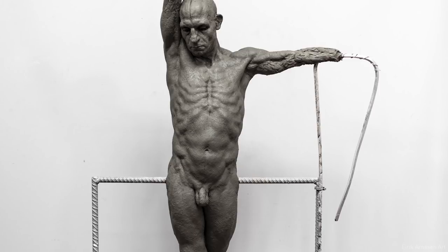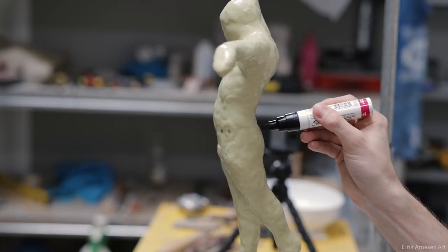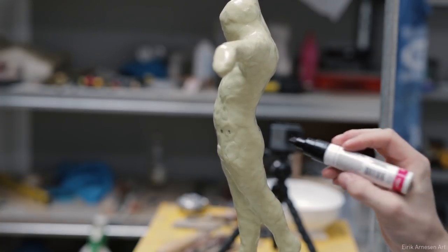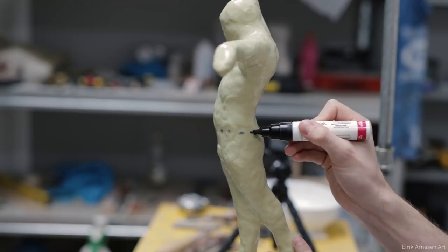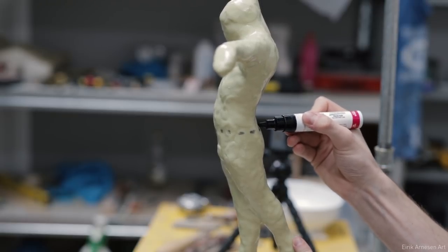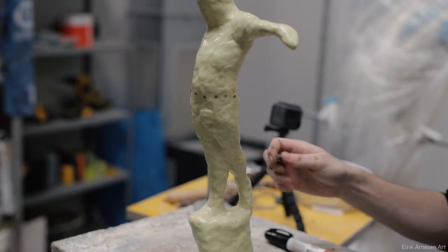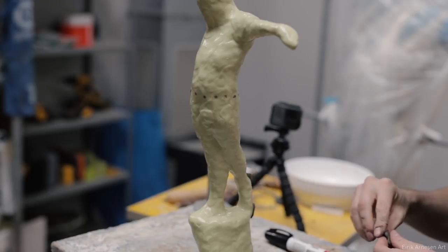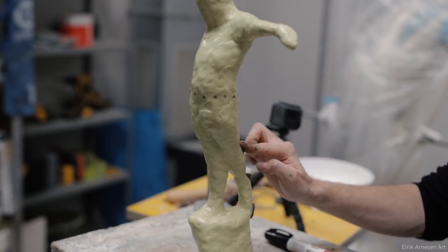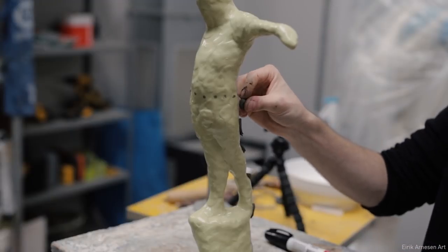You can see the armature coming into the hips here, and that's where I'm going to part the upper and lower part of the mold. It doesn't matter so much where I part this particular mold, because there is no armature sticking out of the hips and it's pretty small, but doing it this way makes it a bit easier to cast because it's easier to get to my seams everywhere. I mark where I'm going to build my silicone wall with a black marker — it's right above the waist around the hips area. Always attempt to part your silicone in two, not three, not four. Two is always easier and usually possible.